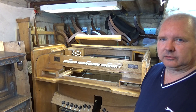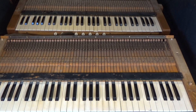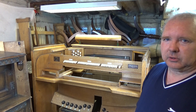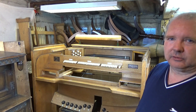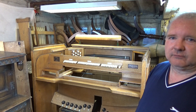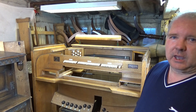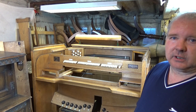That's the end of the first part of our series on this pipe organ console being converted to a MIDI virtual organ console. The keyboards are out and in the car ready to go to the keyboard restorer. In the next part we'll look at getting the restored keyboards back in, checking the contacts, the thumb pistons and toe pistons, and looking at these motorized stop tabs to find out what voltage they are. We'll be using the universal MIDI encoder and interface board for this job, and also the Decoder 128 because that will drive all the motorized stop tabs. See you in the next part.